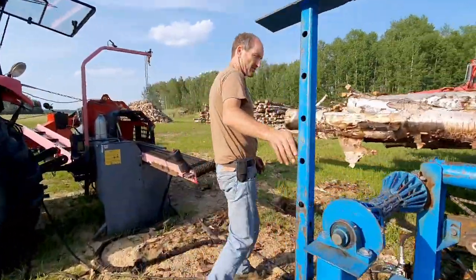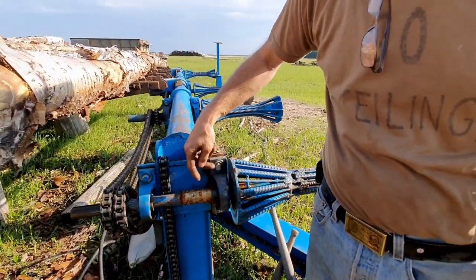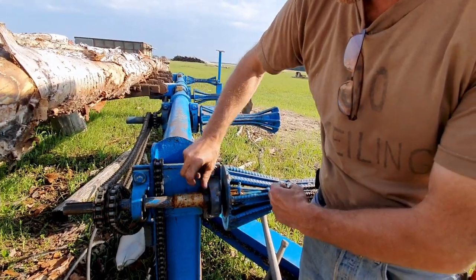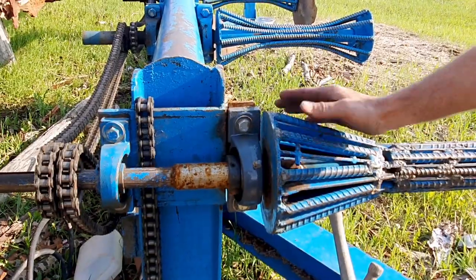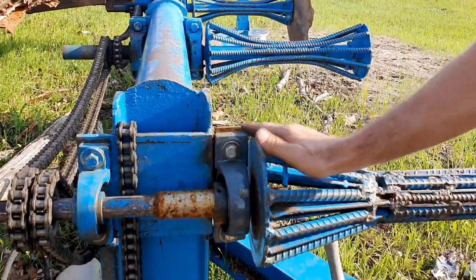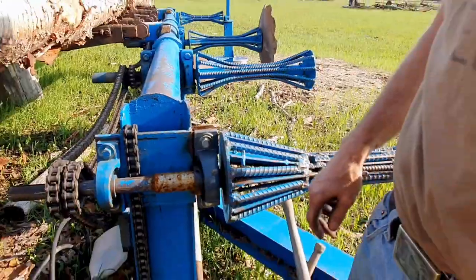And here's the other repair. I broke this shaft, right? So we ended up machining inside and made a collar to fit all this so that the bearings would all fit in different sizes. It really sucked, but we got it lined up so that now it's supported here so that the bearing isn't just being bounced and breaking the shaft again. Touch wood, it stays that way.